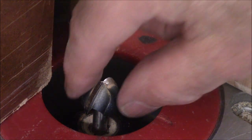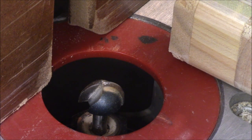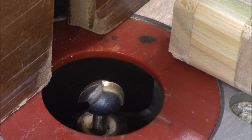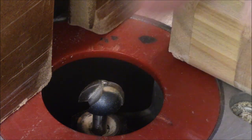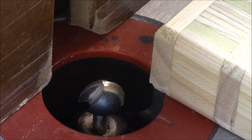I've got a bullnose bit in there now — it's kind of a rounded radius kind of deal. It puts a round slot and we're going to put little hand holes on two sides of our cutting boards. Pretty easy process — let me show you.